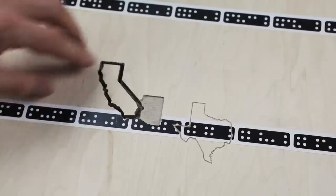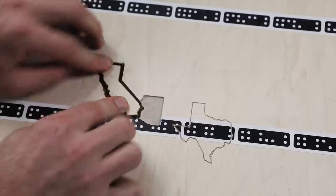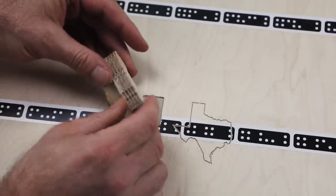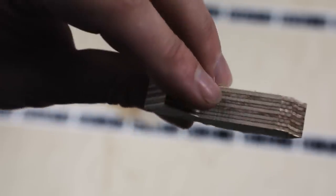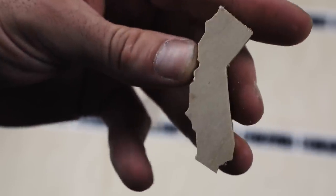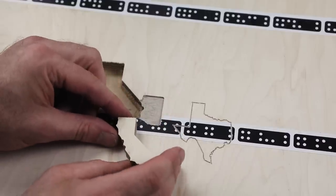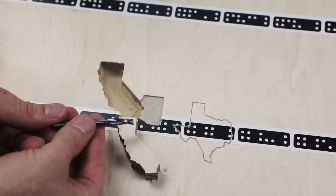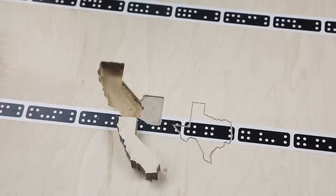Okay, move that to the side. So there's a California cutout. That's with an 1/8 inch cutter, and we were using a roughing pass for the first several passes, and then a finishing pass to finish up. So you can see the results, very clean, accurate cuts, and that's all due to the way we handled finishing passes there. If we wanted to cut this quicker, we'd use a bigger cutter, a bigger diameter. So this is a 1/4 inch example. We used an 1/8 inch.